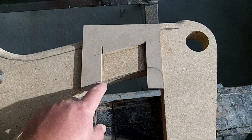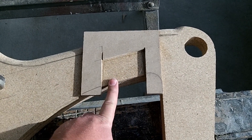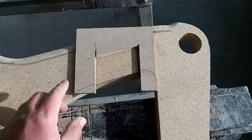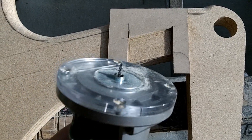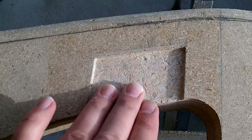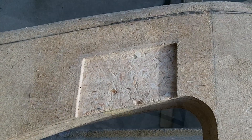Like I was telling you, I've got to route this down a bit because the front derailleur can't stick out as far as this seat tube sticks out. What I've done is put this template on here — I just used that Super 77 spray. It's awesome stuff because it'll pop off when I'm done. I've got a guide on this trim router and I'll just follow this around. I went ahead and routed this out and it turned out pretty good. That template and guide works really nice on the router, so I took a little sandpaper to it. For the rough cut, that worked out pretty good.